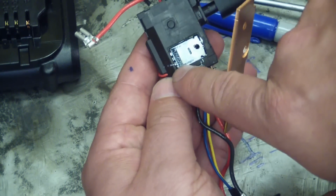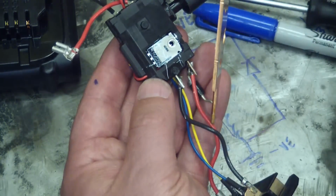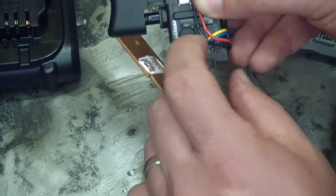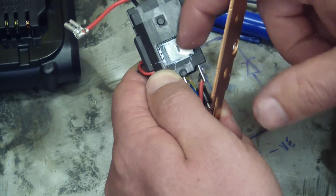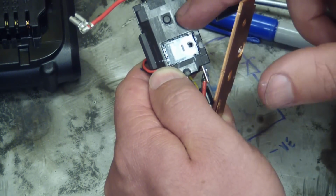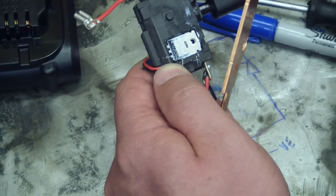And there's our little switch. That'd be a MOSFET. Essentially a relay. So this electronic stuff, it can't handle the 20 volts, or actually the switch. Pretty telling here. You see the switch is rated for 11 amps, 18 volts DC. But the electronics in this can probably only handle 3.3 volts, maybe 5 volts, depending. The 18 volts would fry it, so it needs a relay in order to run that 18 volts.